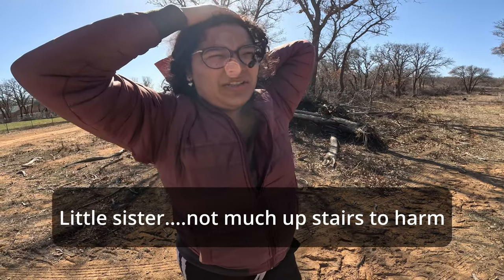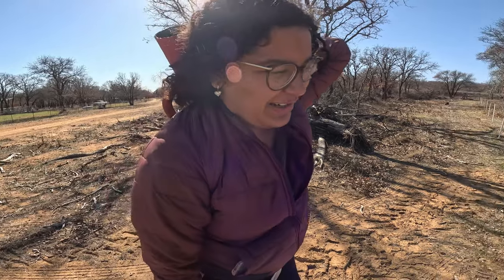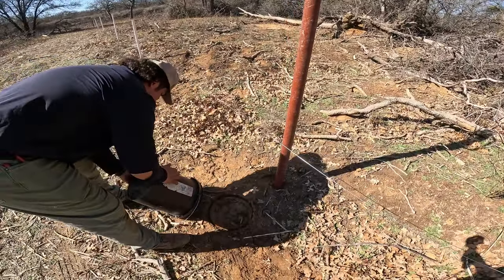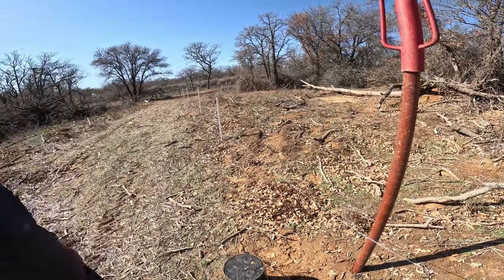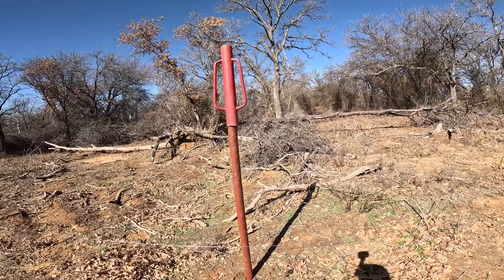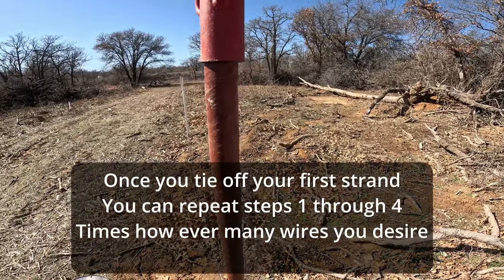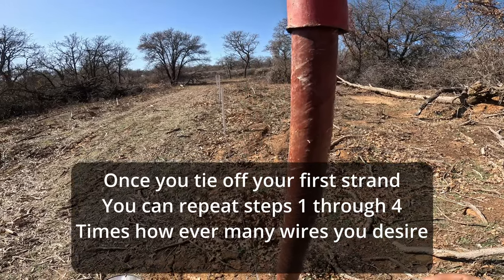Today at Bear Family Farms — I'm going to sue because the tractor was in my way and I have a concussion and I'm still out here working. Since we're in a gully here, we are putting these bigger posts in to help keep the wire from pulling those white ones out of the ground, since they're not deep enough. That's about an eight-foot pole. We're going to pound it probably about three or four feet in the ground and then take a drill and drill through the back end of this. It's just a fiberglass coated two-inch hollow piece of pipe, and then we'll drill a hole through and take some tie wire and tie that.